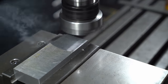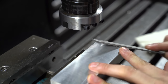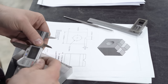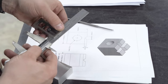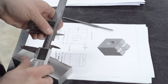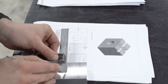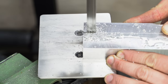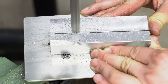My mill is not perfectly trammed — it's a tiny fraction of a degree tilted anti-clockwise, but it's so close that I'm not going to mess with it. The block is currently too wide so I'm going to set my square to 30mm, then double-check it against the calipers and scribe out a 30mm line. If my brain wasn't on holiday today I'd have used the height gauge on the surface plate, because that's exactly what it's for. Here we are chopping that 30mm block off — the new little bandsaw table is a joy, I wish I'd done this sooner.